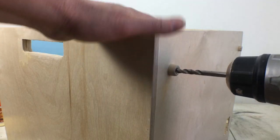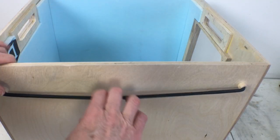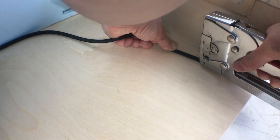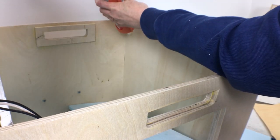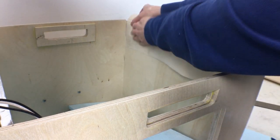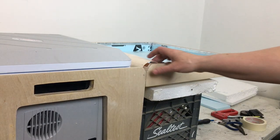Now that the glue is dry, I can take out the screws and drill out the hole in the box. The cord is then threaded through and pulled tight — I'm going to staple it down using a stapler with U-shaped staples used for securing wiring. Since I wanted the wooden lid and the cooler lid to lift in one movement, the simplest way was to use the cooler's own hinge rather than fitting a second hinge onto the box. To hide the gap at the back, which will be visible from the bed side of the cooler, I'm adding a strip of vinyl fabric. I've glued it to the inside of the main box and will glue it into the lid as I attach the lid to the cooler.